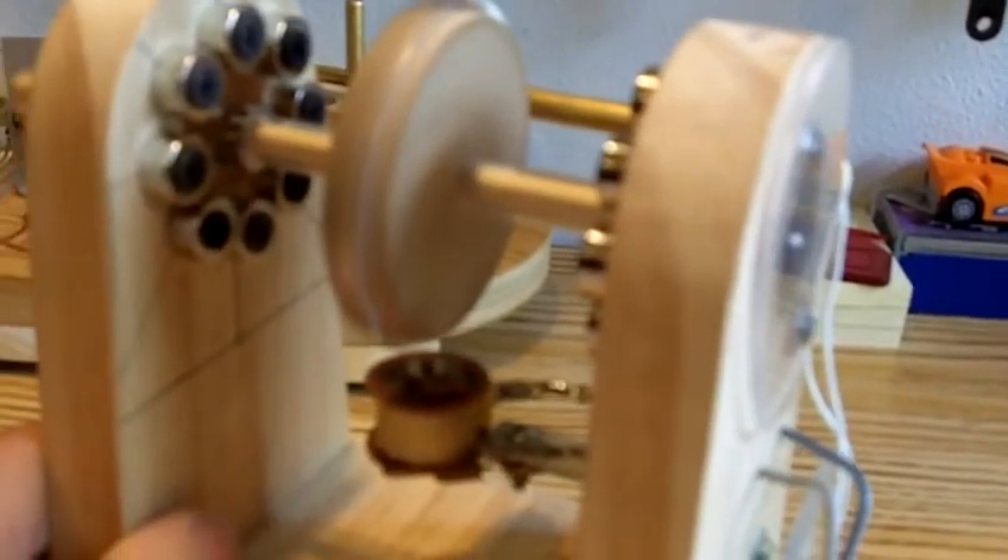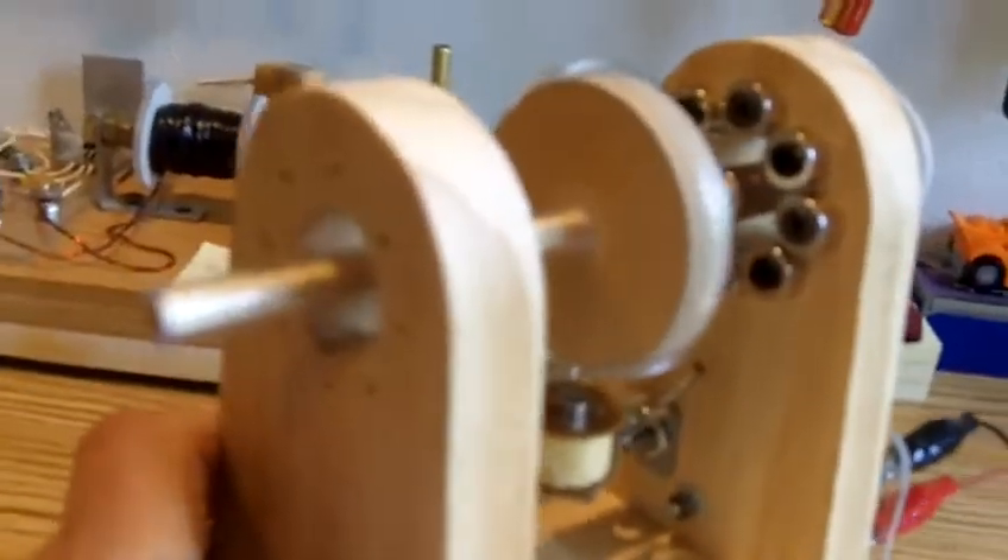I started out with some pretty crude things, but this one's very nice. I'm hoping sometime to build one all out of clear plastic so it can be seen very readily how it works. The electronics are right over here — there's a transistor right there. The reed switch up here is triggering the transistor, and the transistor in turn is energizing this coil, which is attracting the next magnet coming around on the armature. It works pretty darn nice.